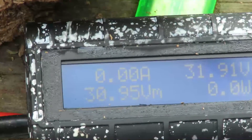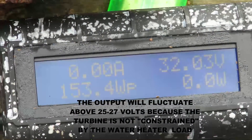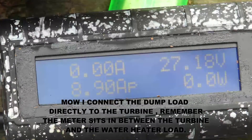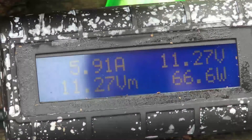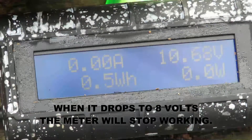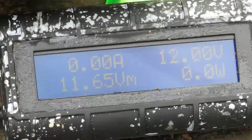Unfortunately the turbine just isn't providing enough power to run directly off it, because as you'll see it will just slow the turbine down and then it will stop. I'm going to plug it in now. See the wattage go up and the voltage start coming down quickly — the turbine is basically fighting a losing battle. Now I've taken the load off, you'll see the voltage should start to come back up.